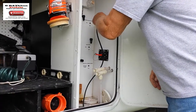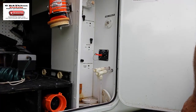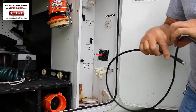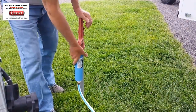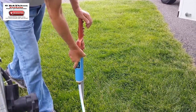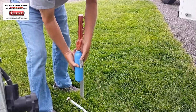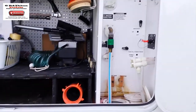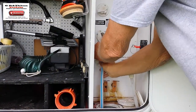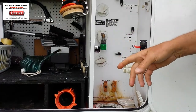You're going to want to unhook your cable — you don't want that dragging behind you. Also unhook it from your main supply. Before you unhook your hose, make sure you turn the water off first, then let a little pressure out, then take the hose off. These little inline filters are a good idea and they're not too expensive. Once unhooked, disconnect your hose — mine has a quick-release fitting.